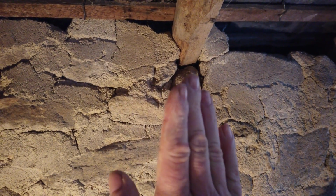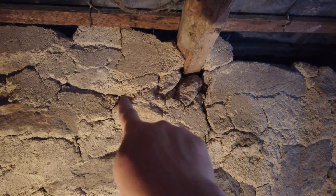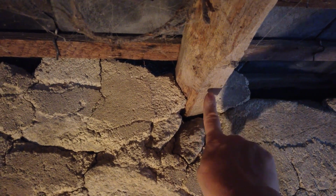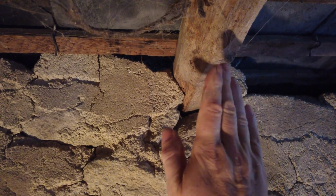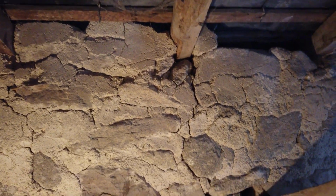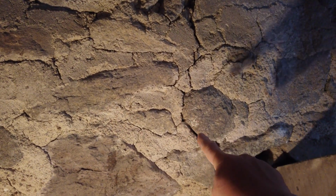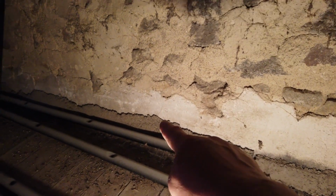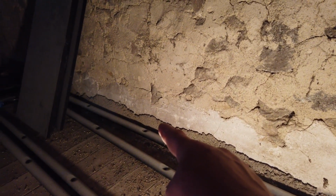And if I pan up to here, this roof is now leaning that way, and that would have come to about there, so it's tilting that way. So you know, there's obviously quite a serious problem. You can see there's a crack line running all the way down here. Yeah, so there's quite a serious arch to the front, and this ridge of concrete gets wider towards the centre of the house.